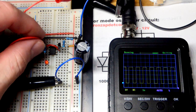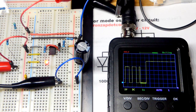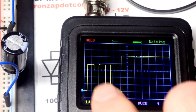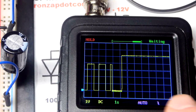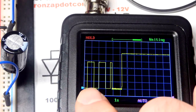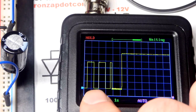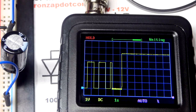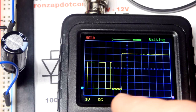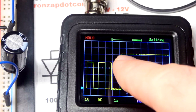I have the capacitor in here - we'll remove it after. You can see a pretty much square wave there, hopefully about even. Now I'll move the probe to the positive rail - you can see the waveform is wavering a little at the top but holding voltage pretty steady. There's our zero volt point. We've got one, two, three - a little less than four volts - at one volt per division. Each square across is one second, and it looks like it's high about one second and low for a little less than one second. We could remove the diode to change the duty cycle, but this is still okay.